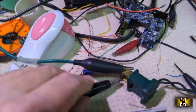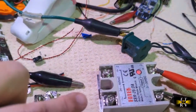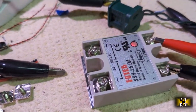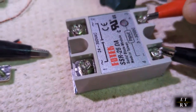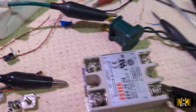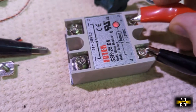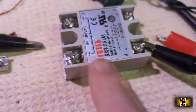Just like plugging it into a wall outlet. Now I'm going to connect it to the output of this device — the output of the solid state switch. You can see I've got the DC input right here. You can see the LED responding. I'm just sending it 12 volts — could be anything above 3 volts — but this is going to be the control signal. All I do is apply that voltage right there, and again the LED comes on. These are totally isolated from each other.